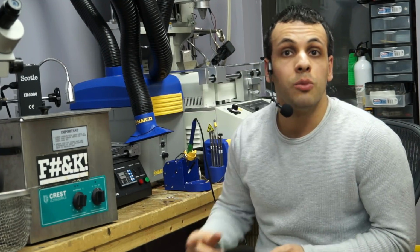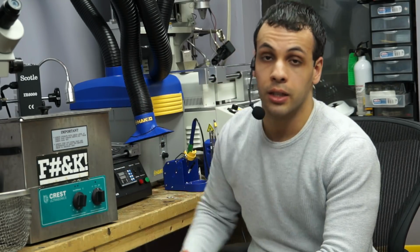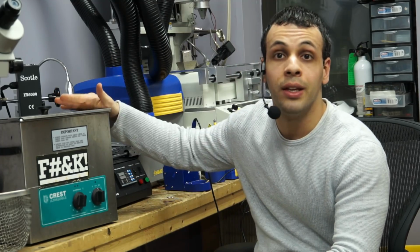Then you go out and you buy something called Branson EC. Websites like Allspec sell these things by the gallon or by the 5 gallons. If you're doing this for a living, I would suggest you buy 5 gallons because you are going to get a discount on it, and you're also going to be using this stuff, and it's not that much of an investment. So the whole idea here, you use 103 milliliters. 103 milliliters, not the whole gallon. You use 103 milliliters of Bransonic EC to 1 gallon of water.